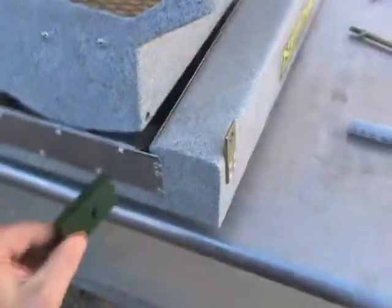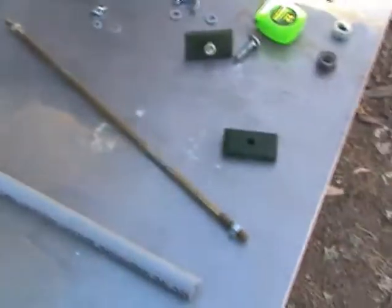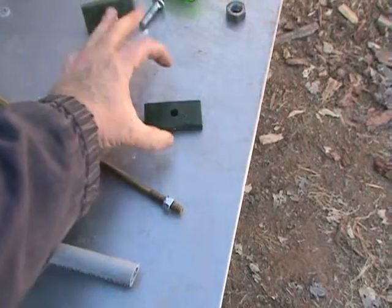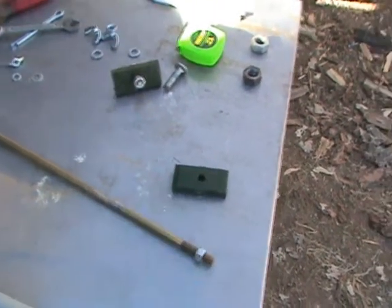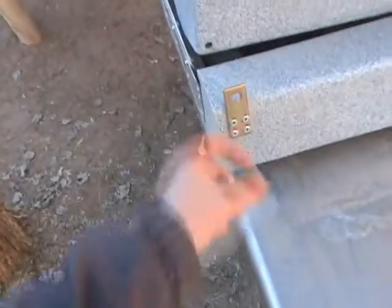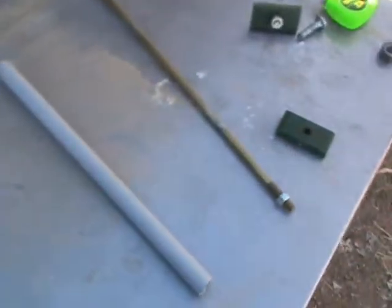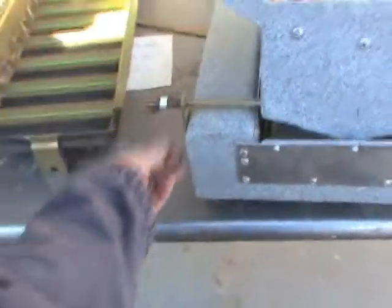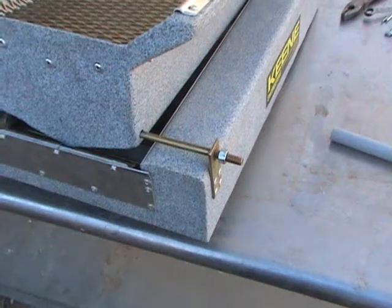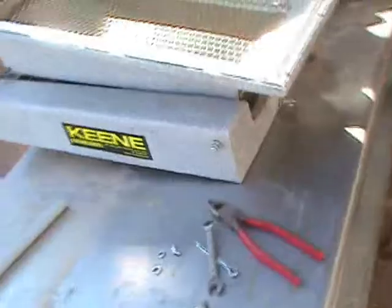I'm going to use 1/2-inch steel plate, and I'm going to cut it on the chop saw, but I need to know the height of what I need to cut, and then I'll put the hole in there to center the rod. So the next step is to put the rod through. Okay. Note, by the way, that when I'm working with threaded material, I always put the bolts back on just in case I ding the threads like I did when I was straightening them.